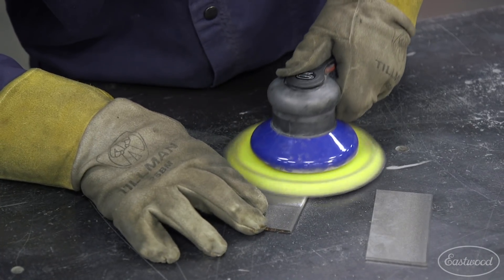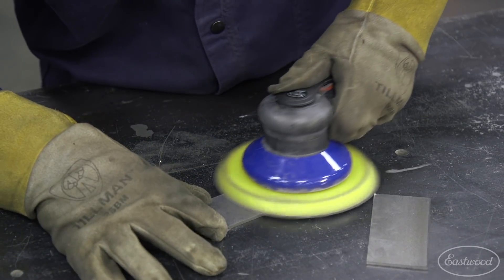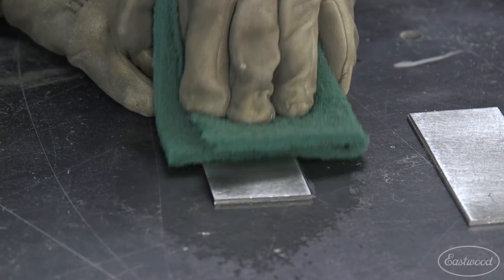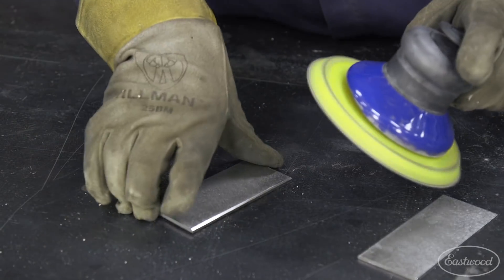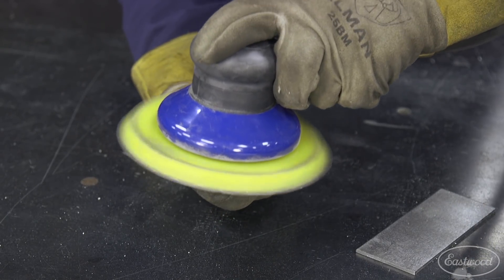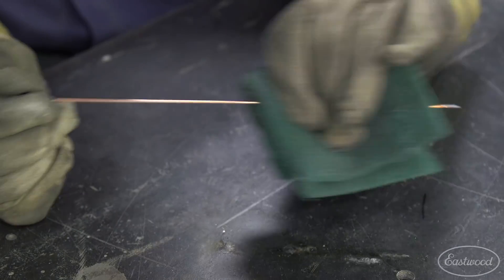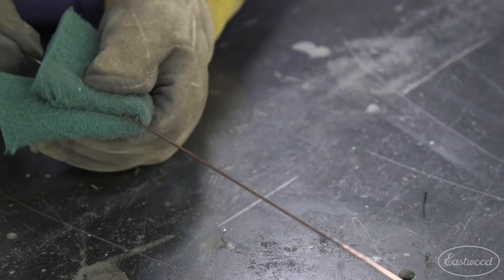Also make sure that the metal is free of any contaminants. Remove any paint, rust, or coating first, and then use acetone or low VOC pre to clean any grease or residue off of the metal. Don't forget to clean the edges and the back side of the weld seams, as those hidden areas could cause occasional popping or spitting of the weld puddle, which can leave a pit in your weld. Make a practice also of cleaning your filler rod with a scuff pad and low VOC pre or acetone before using, for the same reason.